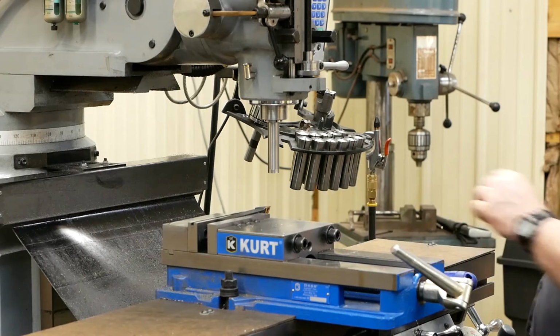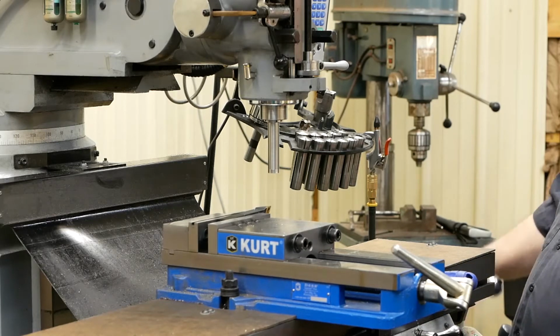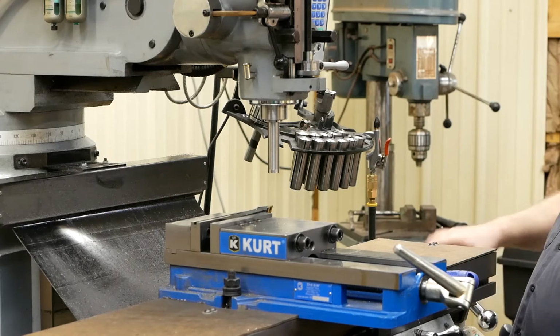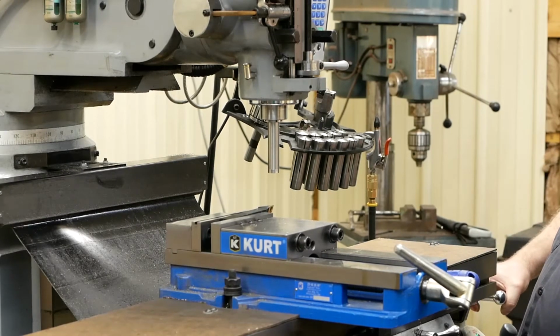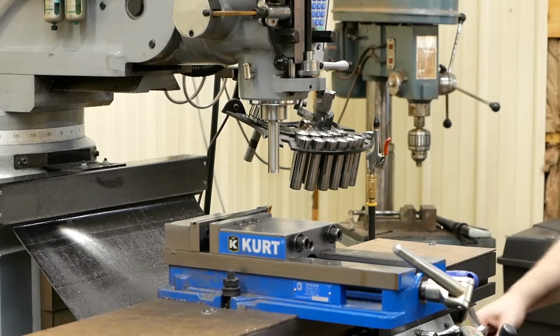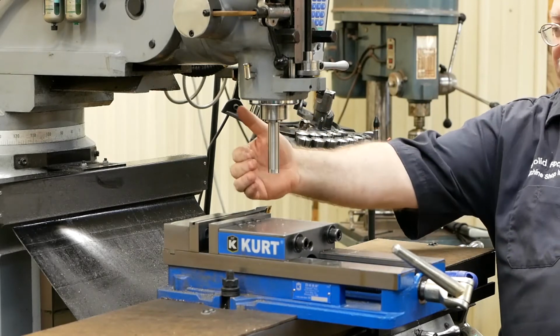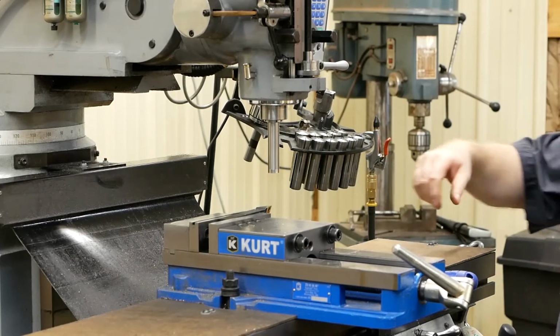Or 743 on the diameter. I'm going to move over 371.5. Reset the digital to 0, and I know I'm cutting per side, but as I move in 1/1000ths, I'm cutting 1/1000th per side. I'm getting 2 out the diameter.